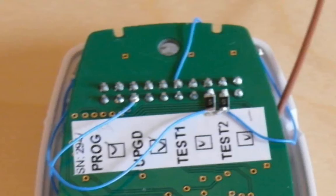Then there are two resistors connected to pin 3 and 5 on the JTAG connector, and also a wire going to the other side of the reset switch to pin 15. I'm using 470 ohm current limit resistors for our LEDs. These JTAG signals are the TDI and T-reset signals, which in serial wire mode are not needed for connection. These correspond to PB4 and PA15. As long as these signals are connected to your target, you can use them any way you'd like — perhaps as a system heartbeat or for measuring the timing of an interrupt handler.